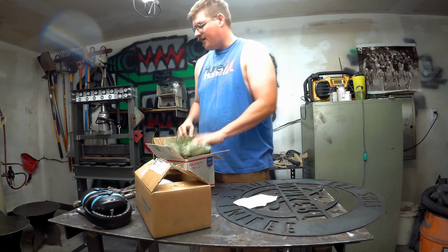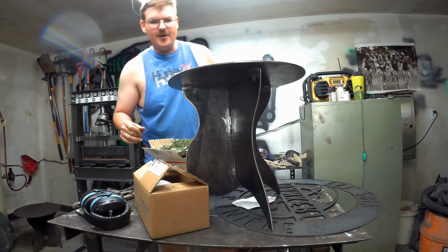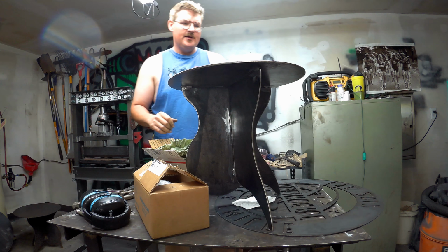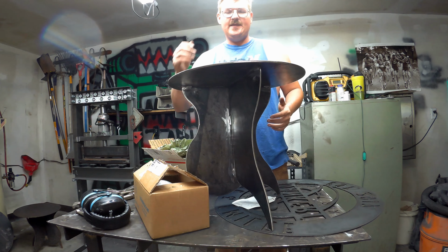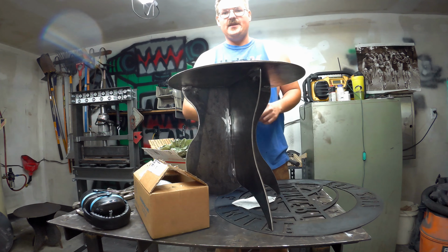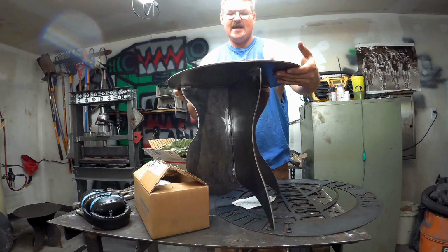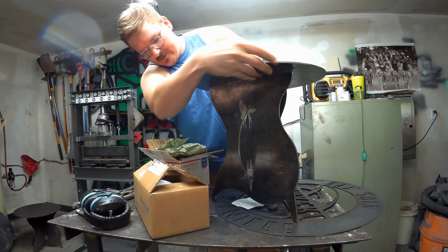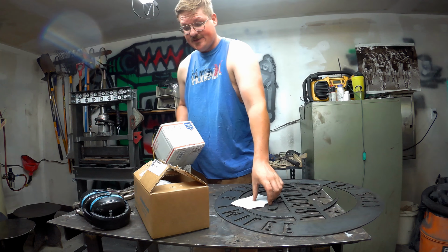So I gotta give that a shot for this project over here, which I've got this really high-end carpenter designer named Caleb Woodard here in town that basically I just cold called him. I walked into his shop and introduced myself, gave him a card and started talking to him, and that turned into a bunch of business actually over the last few months. So all these pieces I worked up in CAD and then cut them out on the plasma table, and they all tab and slot, fit together, jigs itself up basically was the idea. So hopefully this stuff works, we'll see. Either way, that stuff has to get powder coated, and I'd rather not fill all those seams up with weld and buff them all down. That would take a long time. This stuff should sand a little faster and go on a little faster.